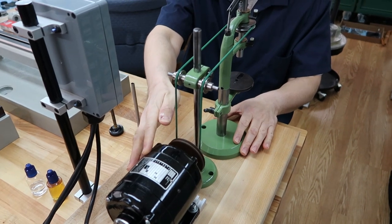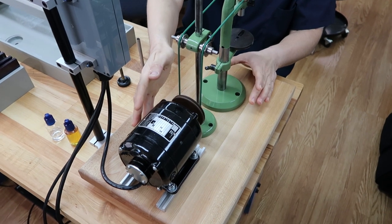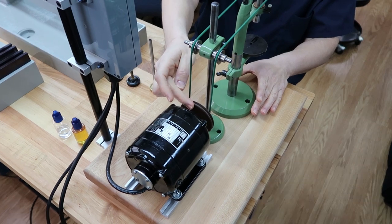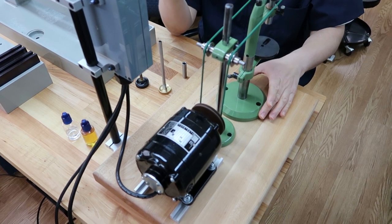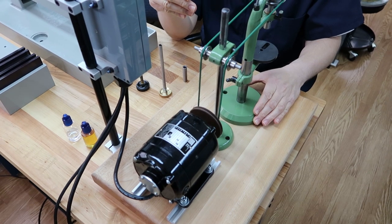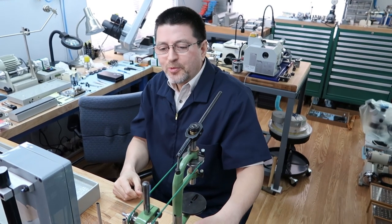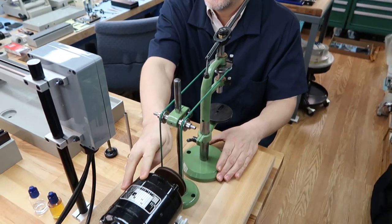Many of you will remember we tried an older universal AC/DC motor, and unfortunately that didn't work out. We're really sad because it was an older motor that had the oil ports. I forget, what was it, Lance? Do you remember we had some issues with the speed control? Unless it's under back pressure, it couldn't do enough. Without any torque on the motor, it was going like 15,000 RPM. It's great for a pump motor, it has to have constant back pressure. Okay, that's right. So we went with a DC motor, and it works great.